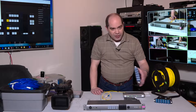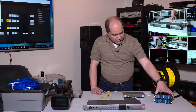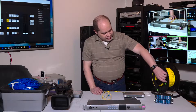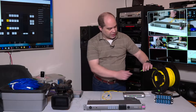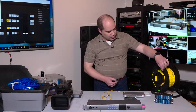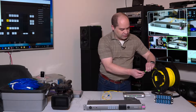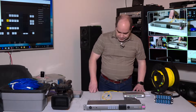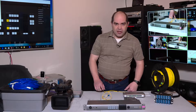I've got these boxes that allow me to send 24 fiber signals over a couple of MTP connections. One cable holds 12 signals — 6 cameras, since they're bidirectional — over a single cable. That's been very handy. I'll also wire up a camera to a camera converter so you can see how that works, and discuss how it all works along the way.